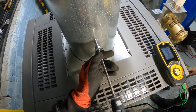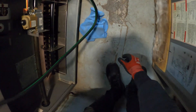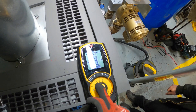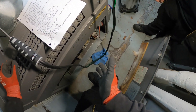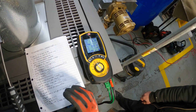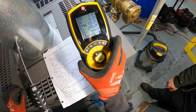We're back at the boiler. I've got my hole drilled — that should be a safe place to keep the probe. Let's turn this boiler on. Set to 150. We have different settings: Aux, Flue 1, Flue 2, and Temp. We really want to get a good reading at about 5 to 10 minutes. There are multiple stages, so you'll want to get a reading at both stages. Let's check Flue 1. The pump is running — let's give it some time and let this thing average out.